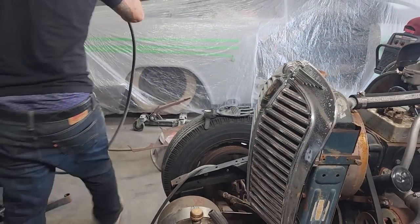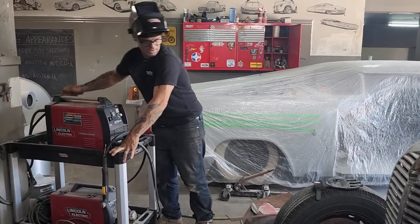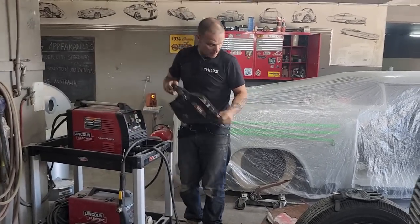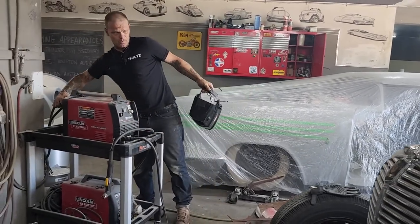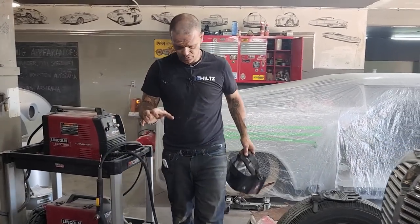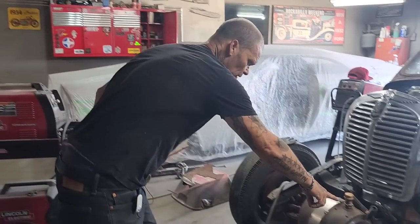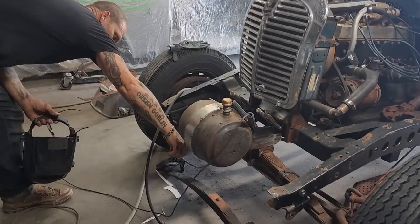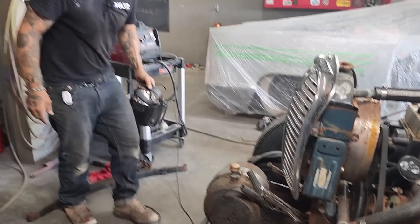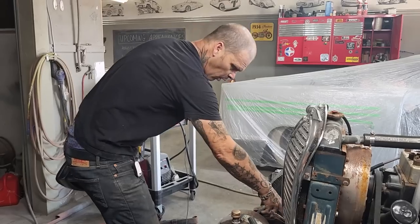So basically, I guess that's what I'm showing you. Moon tank. I guess it's how fast can you make a tank for your car. So we've taken two headlights. We've widened them out 2 inches. Cleaned the inside out. We put a spout on it, an outlet for the gas to come out. We've made two brackets, and then we got two holes to bolt it on.